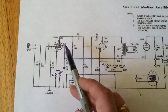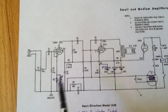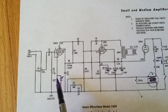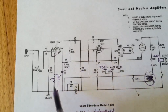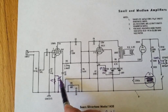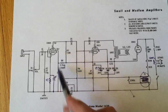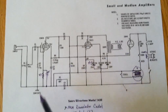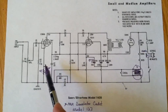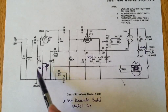The preamp tube is a 12AU6, which is a pentode, which gives you a lot of good gain for a small tube. But it didn't have any bypass capacitor or resistor to ground — it was just biased direct to ground. So I've added a bias resistor of 47 ohms and a bypass capacitor of 25 microfarads, and that has actually beefed up the tone considerably.